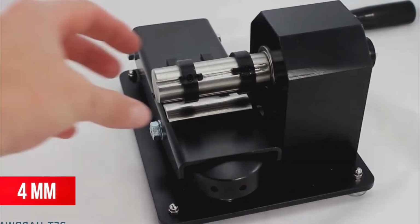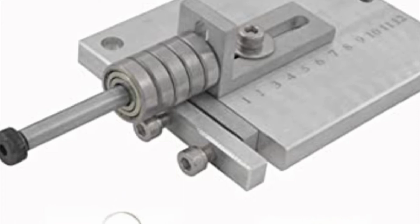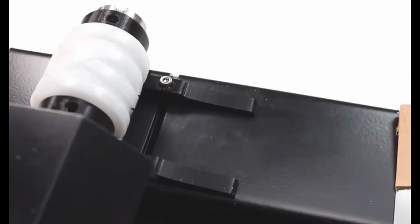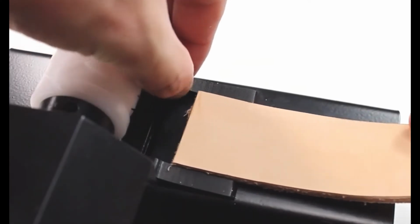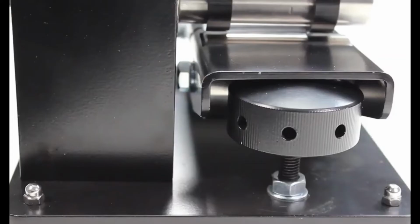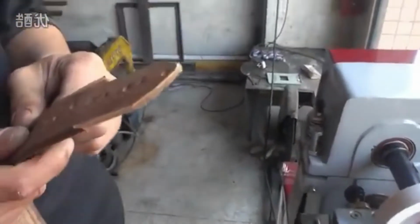Four 4mm blades with a reversible grinding on both sides are included with the Bark Cutter Pro Belt. Two of the blades are connected in the middle on one side of the drum. On the opposite side's outer edge, the other two are joined. This eliminates the need for larger grafts, which other machines can produce, and mills the full width of the drum in a more balanced manner. There's everything needed right in the box.